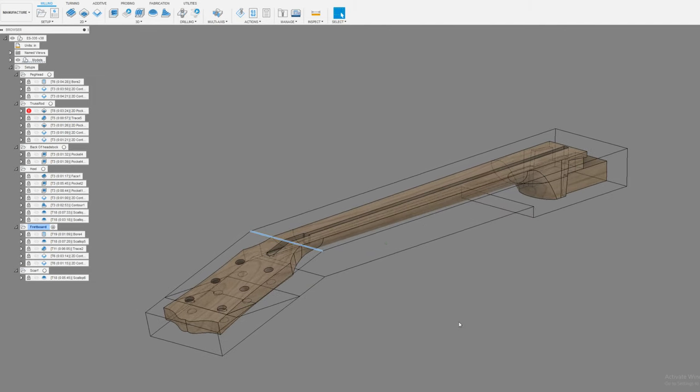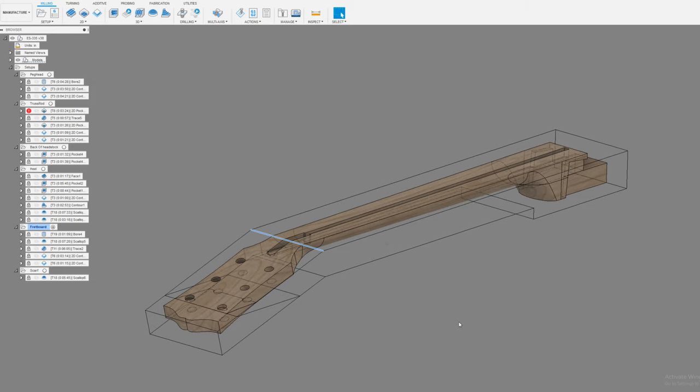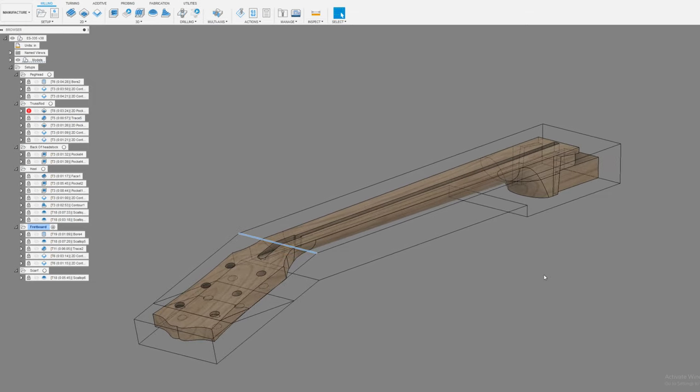So, you know, you're dealing with tolerance stack here. So any error in how you indicate off of these is gonna amplify your error. And when you start doing curved surfaces, that's where it really shows up. So the way I set up this one, it was incredibly accurate. So I'm really happy with it. I feel like I'm starting to get to the point where I can show you guys what I'm doing because I'm finally kind of confident with it.